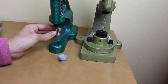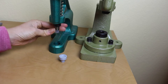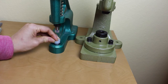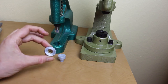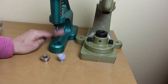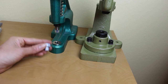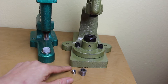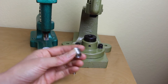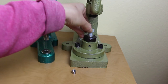The top KX die will fit in the DK-93 press without any problems. The bottom die, however, is too small to fit this large hole. And here we have an adapter base. This is the DK-93 to KX adapter base. You place the base in the bottom hole of the DK-93 press and now that hole becomes smaller so it can accommodate the smaller KX bottom die. Similarly, we have a different adapter set for the DK-98 table press. Again, there's the bottom adapter so that the bottom KX die can fit that press.